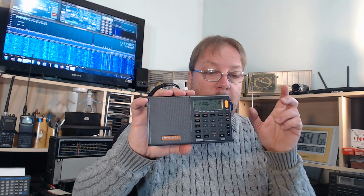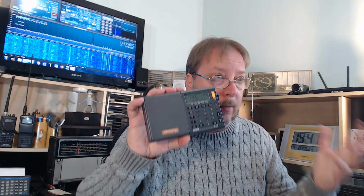Medium wave is quite good, and one of the reasons, and I have actually seen an article on shortwavelistening.com where somebody has actually opened the radio and we see the insides. He was asking himself why medium wave was so good on the D808, and it has a longer ferrite loop antenna, so it actually adds to the sensitivity of the radio. The R108 has one, but it's smaller, and a lot of portable radios today have smaller loops. This one has a bigger loop that takes a bigger chunk of size inside the receiver. It adds to the AM-DX experience.